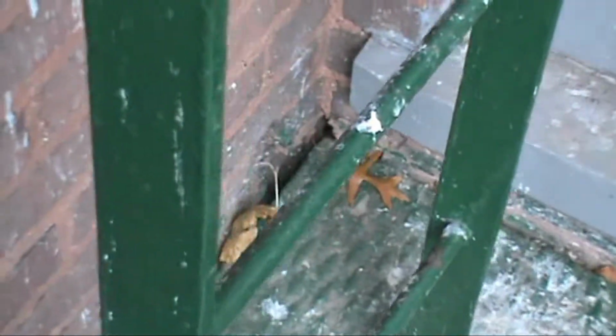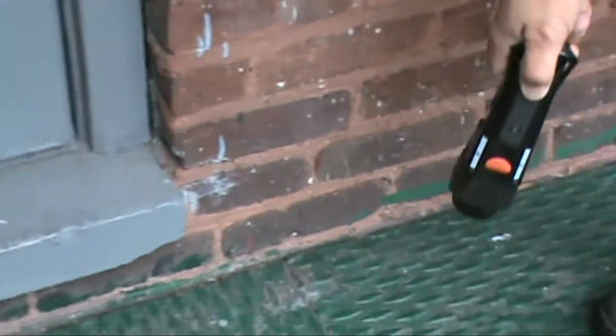Another thing too is that this is causing rusting, because water stays moist. So as soon as they seal this whole area up, all this needs to be sealed. Because one of the other critical things that they put here is ice salt to de-ice this fire escape, and that's one of the major causes of how much rust has happened on this fire escape. The other thing too, see these joints? These joints should be all sealed, because this is another source of water that gets down into the fire escape below and rots it out.